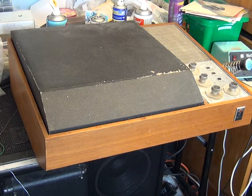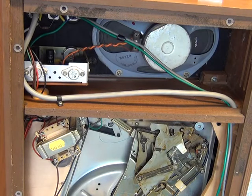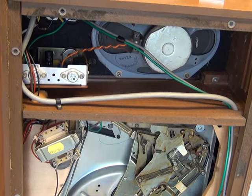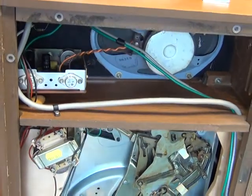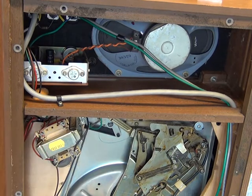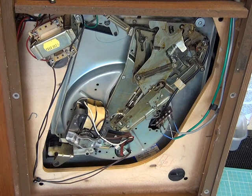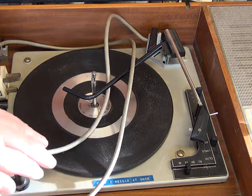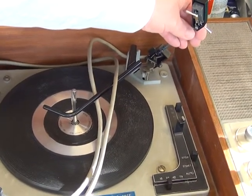If we put it on its side, you can see the amplifier — about five watts RMS output into a really nice speaker, roughly 8 by 5 inches. The amplifier uses the AD162/AD161 complementary pair, and you can just see those nasty black capacitors that Thorn products had at the time — we'll be replacing those before powering up. It has a mains transformer, so it doesn't rely on an overwound motor. The turntable is a BSR MA55, fitted with a BSR C1 stereo cartridge.